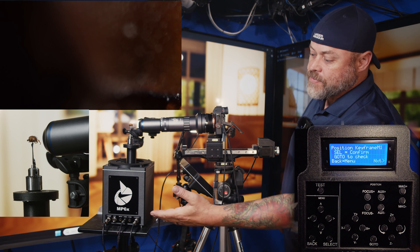When first setting up your system, get everything plugged in before powering it up because there's an initialization process between the controller and the MP6X. The control cable goes into the controller first, then there's an output going to the M1 focus rail. The auxiliary port is for a new product coming later. There's also a USB port on the back. When you first start, you'll be greeted with a firmware page before being taken to the main page.